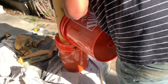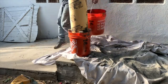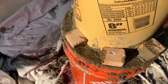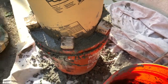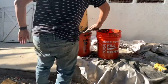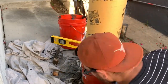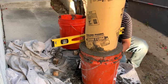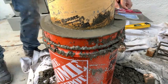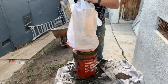I made sure my spacers were evenly spaced because if not, it would warp the bucket unevenly. Once the bucket started getting full, I started shoveling in the remaining concrete since it was impossible to pour at that point because the cardboard was in the way. I let the concrete set for about 30 minutes before taking out the spacers — don't take them out too soon, because the cardboard tube can still shift if the concrete is too wet. Once the spacers were out, I filled in their spots with concrete and started troweling the top. Then I placed a plastic bag over the mold to protect it while the concrete cured.